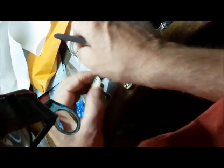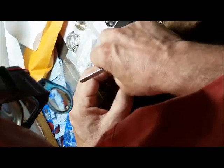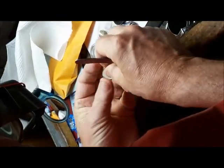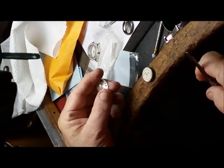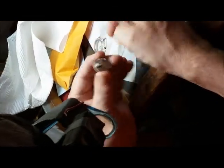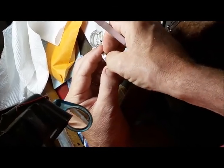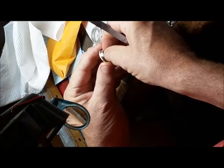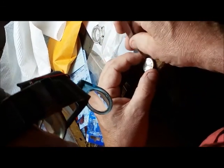The date wheel looks right off — you don't have to remove it with the dial. To complete the procedure, you've got to take the movement out of the case, so you've got to loosen the stem first. There's a screw in the back opposite the stem on the plate — you've got to loosen that to get the stem out. It's a cap dial, so that goes right over it. There's the lineup part, and your dates are from beneath it.